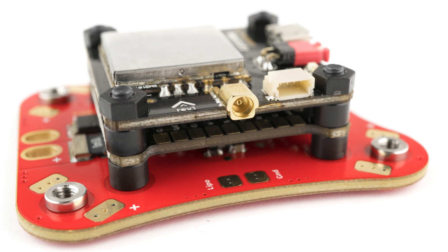Separating the electronics in this way allows us to follow engineering best practices in keeping noisy switching regulators, as well as high current ESC power connections completely isolated from the sensitive gyro on the flight controller, as well as the analog video circuitry in a video transmitter and on-screen display.